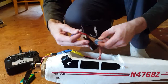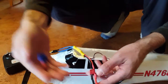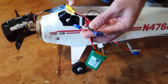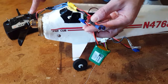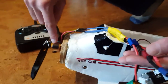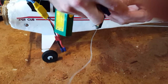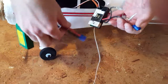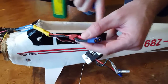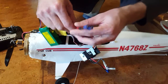Basic wiring: with a brushless motor you plug the battery directly into the wire that goes into the speed controller. This basically turns it into the proper kind of current and reduces the voltage to about 5 volts, and changes it from DC to AC electricity for the brushless, which is kind of a unique thing. The stock setup would have you plug the battery right into the receiver, but with a brushless motor you need to go through the speed controller. The wire goes back to the receiver to send power, and then the receiver is attached to the servos. So this is a bit more of a complicated setup with a brushless upgrade.